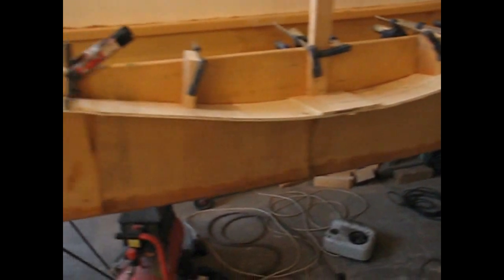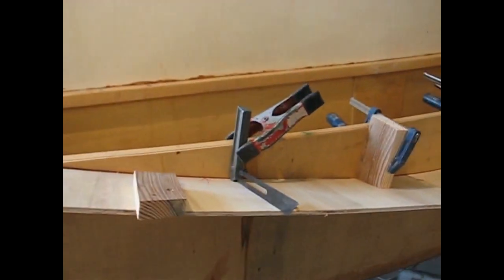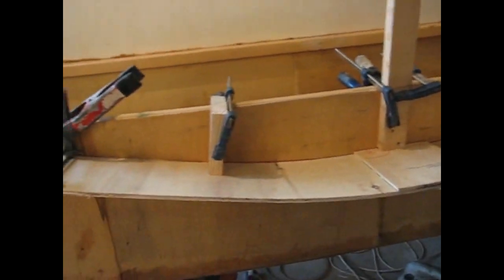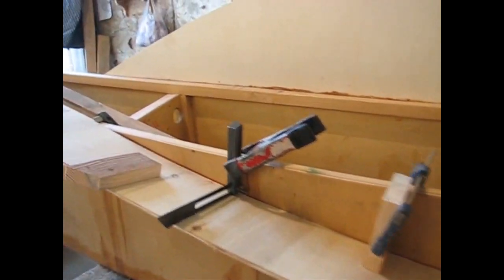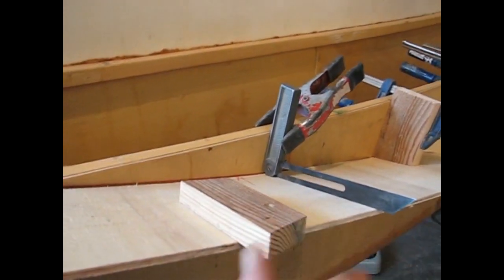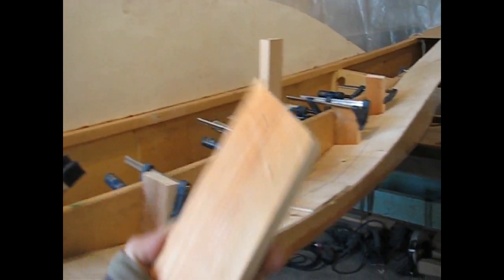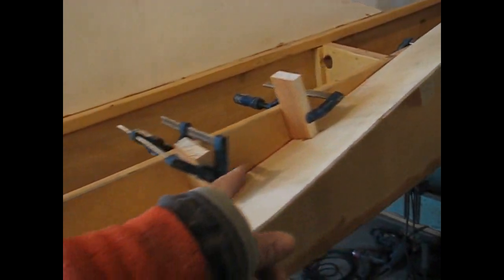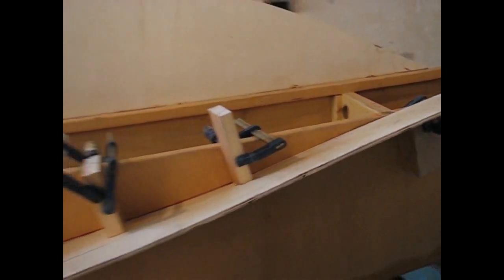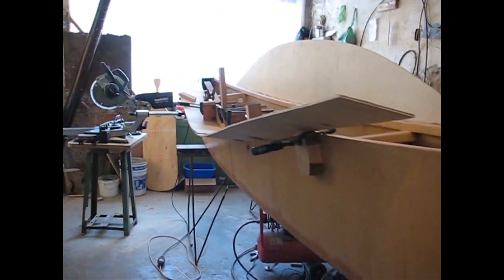Getting the shape of the knuckle is actually fun. This is what I enjoy about boat building — it's just up to your imagination. I'm bending it up like that. I need to hold this floppy piece and get bevels. The bevel square keeps falling off so I just clamp it on there — now it's fixed. I get my bevel, hold this up, move it till I'm happy. Then I go on a chop saw and chop them up, clamp them on, and screw them in from underneath. I really like the shape. That's a nice knuckle — if a wave hits it, the wave is going to get deflected down into the sides.